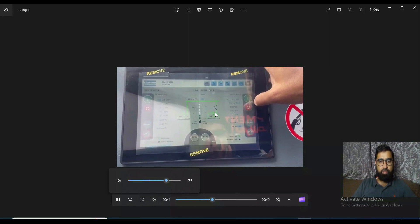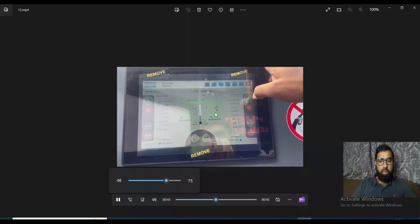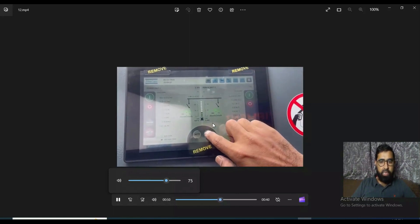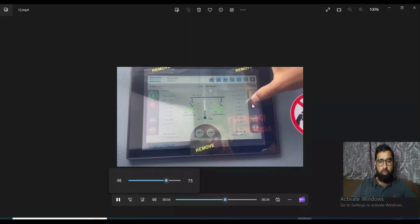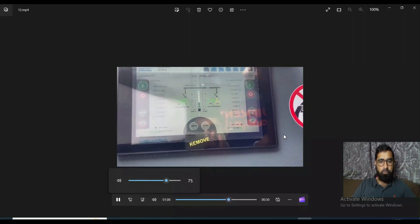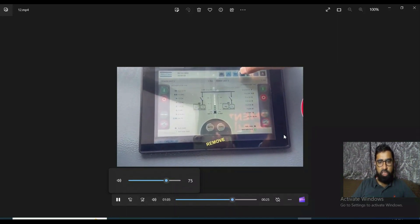As per the settings, one machine starts delivering power to the bus bar and the second machine is ready to take up also. Now the machines are going to cool down, but to save time I will switch to semi-auto mode. In semi-auto you can bypass the cool-down so you can see how easily the machine is to operate.